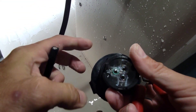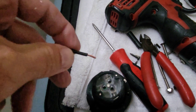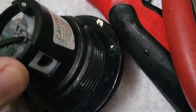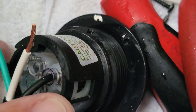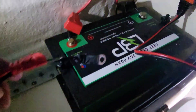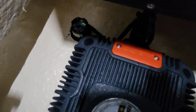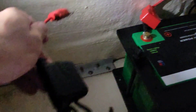I've got our wire stripped back. Make sure you have nothing exposed — put the wire down in the hole with nothing hanging out, then screw down the little screw to lock it in place. Get all three wires in there and stick it back in the hole. The outlet is reinstalled. Now let's get to the battery. On this side we're all tied up on top — I got that tied up nicely. Here is our power and ground, and we also have a big 50-amp fuse that we're going to keep.